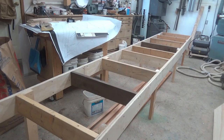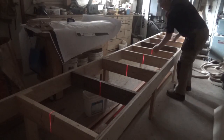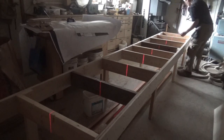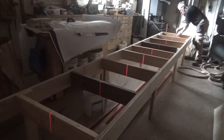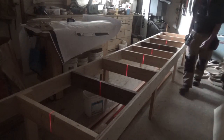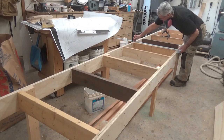I am ready to set the forms on the strongback. I just need a center line right down the center of the strongback and I've got my laser set up. I marked the center of number eight and center of number one, then with my laser attached to my metal garage door — which works really well — with the lights off you can see it a heck of a lot better. I'm going to go along and mark all of the other station areas on the center. One could use a string line, although over the course of a longer distance, moving and stretching a string line can be off by just a tad. I'm going to mark the very end there because that's where the stem will overhang. I'm using my larger drywall square — my other one doesn't span the distance.